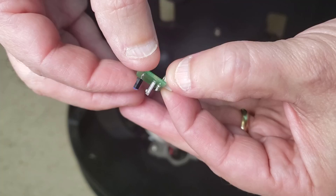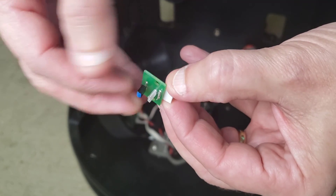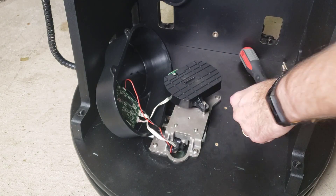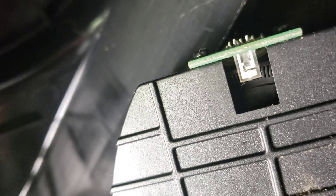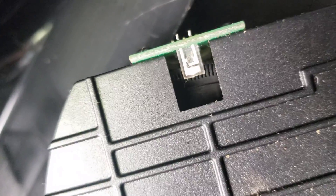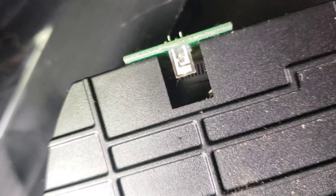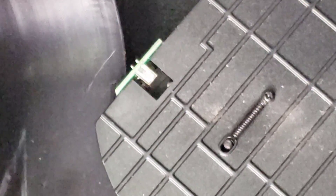Let's see if we can get this focused. Here's the LED — it shines light, and this black part is the sensor that detects the light. The disc spins in between these two in this gap right here. If you look real close, you can see the slots in the encoder wheel. I'm going to spin the whole base, and you should see that wheel spin between the LED and the other side. The system has special gearing that makes the encoder spin much faster than the base is actually spinning, making it much more sensitive to the small angle changes we're used to with a GoTo system.